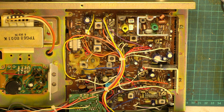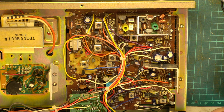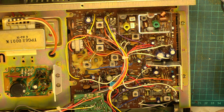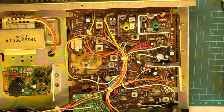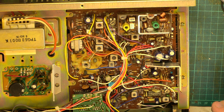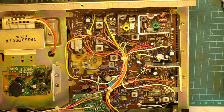Then what we need to do is check on channel 1 and channel 40 that it's somewhere near. So we're now on channel 1, and it's spot on the 4, and now we're on 40. Hey presto, it's spot on the 4. You often get 3.98 or something on one and 4.01 on another, and it really doesn't matter, but we've got it spot on, which is rare. So it's a really good example. We don't need to touch the power supply settings, so we're running it at 13.6 volts, which is better for the radio because it's running cooler.